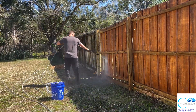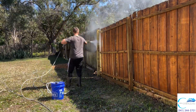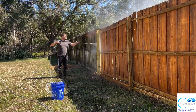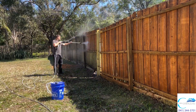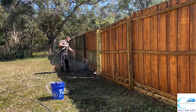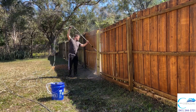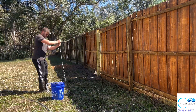The person I was working for wanted to repaint their fence. It already had paint on it, so what I'm doing here is stripping that layer off and also removing the mold and algae. Before I started to pressure wash this, I applied some sodium hypochlorite to the fence just to help kill off the mold and algae. You'll be able to see after I pressure wash this because I post-treat it with some more sodium hypochlorite.